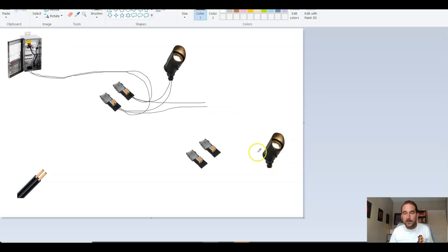Now we're going to go to our next fixture. That 12-2 wire is going to run all the way to wherever that next fixture is going to be. You're going to cut it, bring one wire into one side and the other wire into the other side. And then same thing — if you have another fixture going out next, you're going to run that 12-2 wire out all the way to your next fixture.